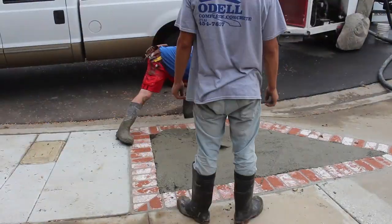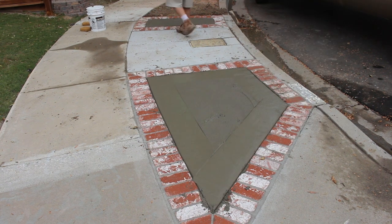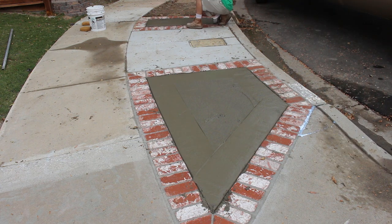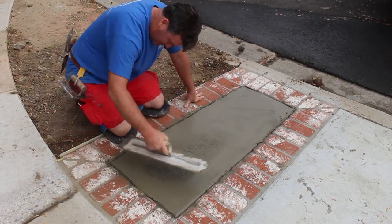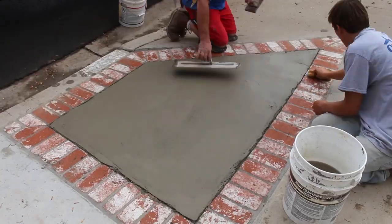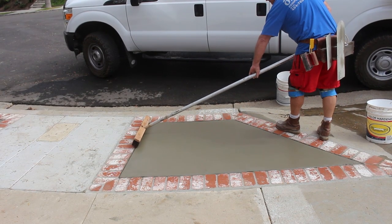Soak the bricks before you grout as well. Another good idea when putting your grout up against the existing concrete is to run a hand edge on the inside edge of that mortar and give it a little radius, because mortar that goes over the top edge of the existing concrete is going to probably chip off eventually. If you just edge that grout where it overlaps the sidewalk, you won't have that problem. You can always come back and run a crack chaser through there to clean it up if that were to happen.